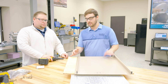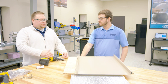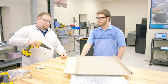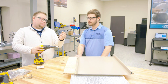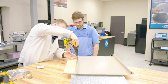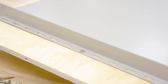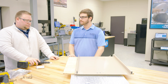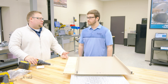Now we're taking a look at the nail flange system, which is pretty popular especially in residential applications. When installing on a nail flange system, it's the same as a clip system — you want to be as vertical as possible, get your hand behind where you're driving the screw, and make sure you don't overdrive it. We're using a ULP — ultra low profile head — with a gimlet point. It's important to note that the fastener is in the middle of the slider section, not over-driving and dimpling the metal. You don't want to be at the edge of the slot because that takes away the panel's ability to move as temperature changes throughout the day.